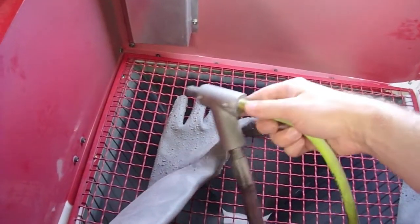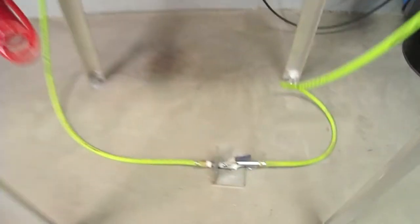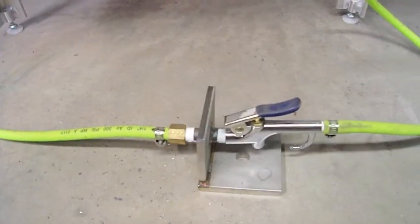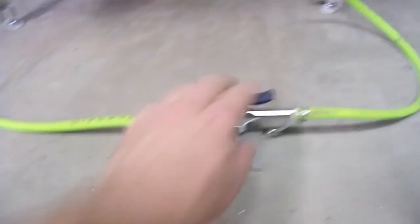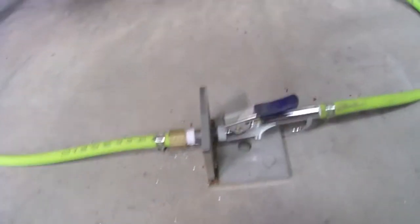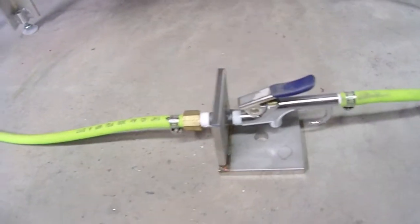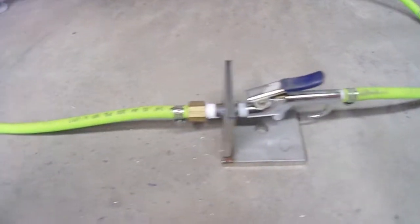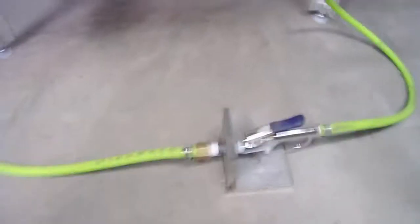with just a regular blower head type that's got a carbide tip on it for wear resistance, and I made up my own little foot pedal you see here. This is a $5 special I believe I got at Lowe's. That's all it is, just a regular air hose blower nozzle, and it fits onto a 1/4 inch pipe thread. So I just took a short pipe nipple and welded it to a couple fairly heavy chunks of steel I had, and fit it up so it held the blower upright. And you can see here I just kind of step on it like that.